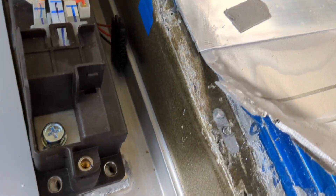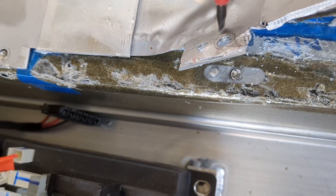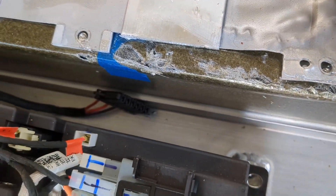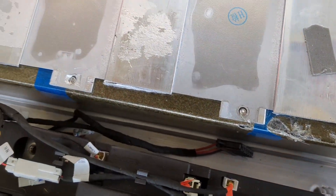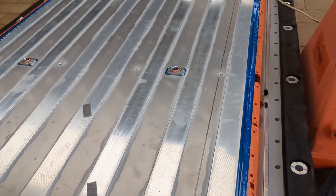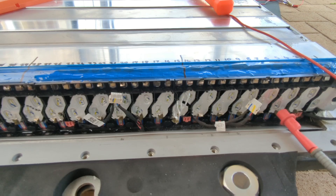The actual cooling plates on top are just riveted in. I've drilled out rivets here, here, here, and a couple more across the centre and at the end. I'm cutting this battery up into 14S lots and going to be paralleling them up. I was originally planning on pulling the cells out and restacking them into the configuration I wanted, but because they're all glued in that's just not going to happen. So I've got to cut these bus bars and rewire it to work how I want.